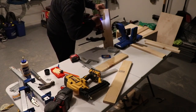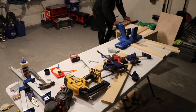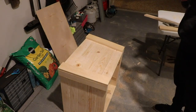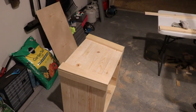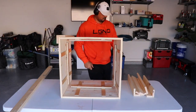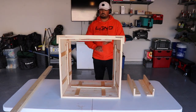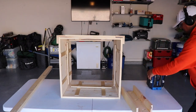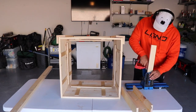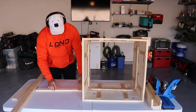Clamping those together, making sure to keep the edges aligned properly. Each one will be specific — two of them are the same and the two for the opposite ends are the same. At some point I decided it's going to look better framed out. I was actually two pieces of six-foot one-by-three short, so I ended up gluing everything. It got a little cold in the garage and the next morning I ran to Lowe's, got two more pieces of wood, and I'm going to build the frame portion of the box using pocket hole screws.